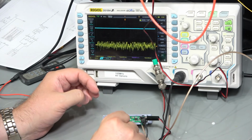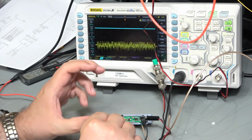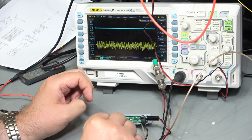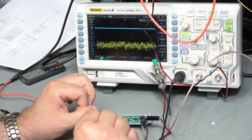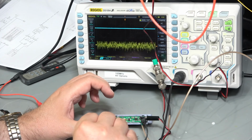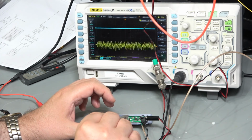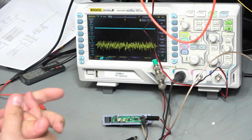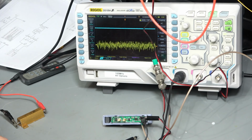The other thing on the zero, by the way, is I talked about doing some nulling using a second sensor. That will remove most of the need for zeroing, although there'll still be a little bit. But I would replace this trimmer-based zeroing with an op-amp based system. So what that would do essentially is you press a button and you would be driving the op-amps to achieve a zero output, so allowing an op-amp to adjust itself, normal feedback circuit really, and storing the voltage that's required to do that in a capacitor. When you release the button, you continue providing that offset to the amplifier circuit, and that's essentially your zero. Now, since the amplifier circuit has an input impedance of about a teraohm, then that capacitive charge lasts for quite a long time.